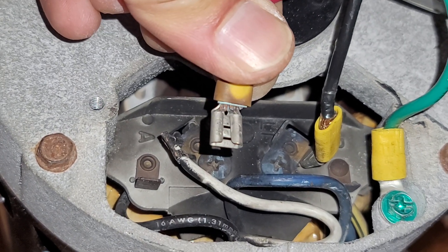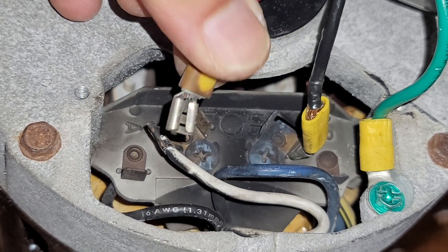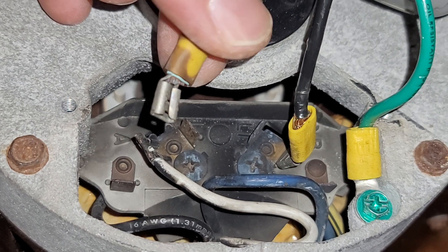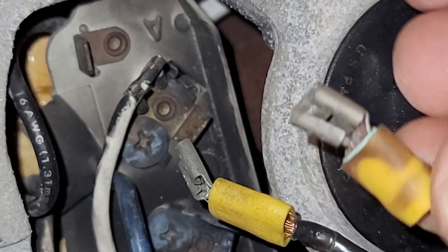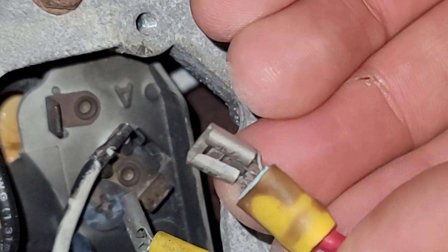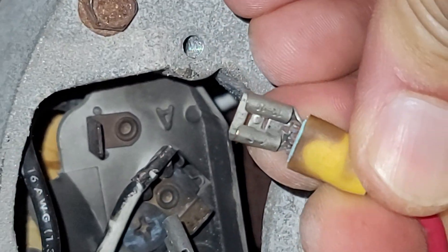They're already pretty close to their current limit, which seems to be about 30 amps. So if this motor is around 20-plus amps, then it's reaching pretty close to that current limit. In fact, you can see that the insulation on this connector is already turning brown, meaning that it was overheating and discoloring the plastic, and probably eventually going to fail.